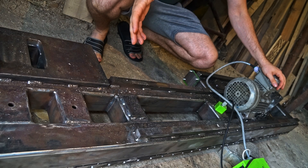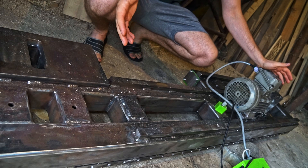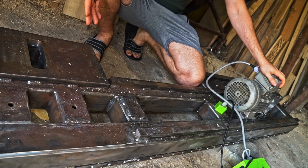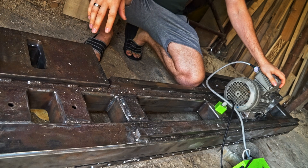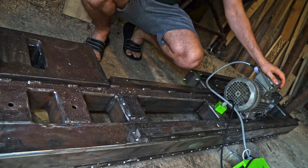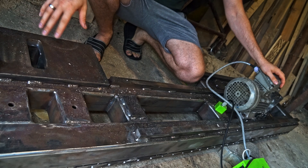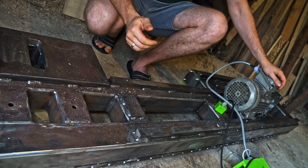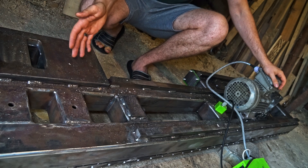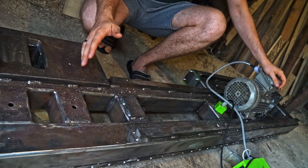After about six hours of vibrating this thing, there should be less stress than before — actually I have no idea if this even worked. After machining we will see if the surface turns banana or not. This frame was already seasoned for maybe six months, and additionally I did the vibration stress relieving. I discovered that this frame has two resonance frequencies: one at about 36Hz, and one at about 20-21Hz. The acceleration measured on the control unit was about 2g, maybe 3g.